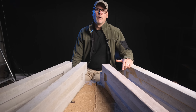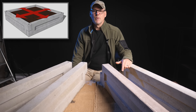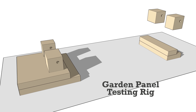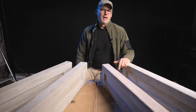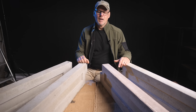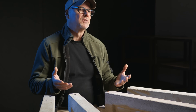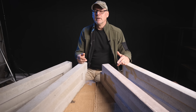This test will be fairly straightforward and comparable to what I did in the last video, Part 1 of this short testing series. I want to simulate the pressure the garden box may endure in the winter when the soil freezes, expands and pushes against the inside face of the panels — I think this might be the greatest load they would be subjected to. I'll suspend the panels on steel rods in a testing rig and apply a point load in the center of the panel, then keep adding more weight to see how much they can handle. These tests are not scientific; I'll be testing only four panels, and that's not a large enough sample size for definitive conclusions. My testing methods are somewhat crude, and the method of making the panels is subject to a whole host of variables I can't completely control or replicate — and that's just how it is.